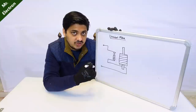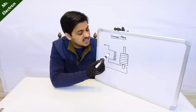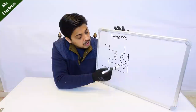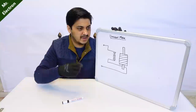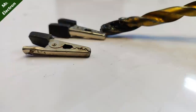Now I'm going to show you with a circuit how it works. The explanation behind it is this diagram - it is of an AC/DC series motor, which is a universal motor. This piece is the armature and this piece is the field winding. Although a universal motor has two field windings, this is just a diagram so I'm showing only a single field winding. Both windings are connected in series, and these two terminals are the final output terminals. Any mechanical part you have - for example a screwdriver - it has residual magnetism, and drill bits also have residual magnetism. Here you will see residual magnetism on this drill bit dragging the clips little by little.